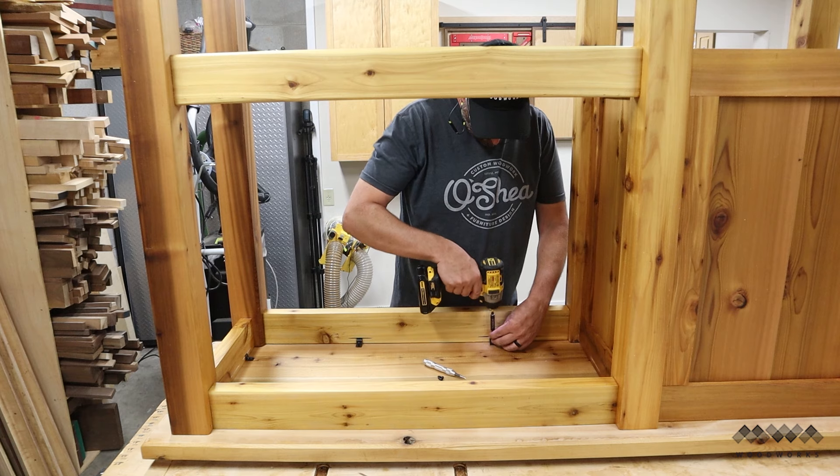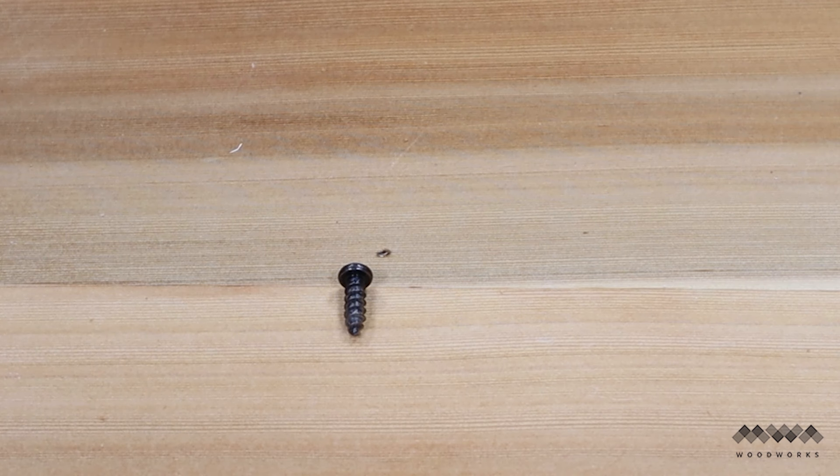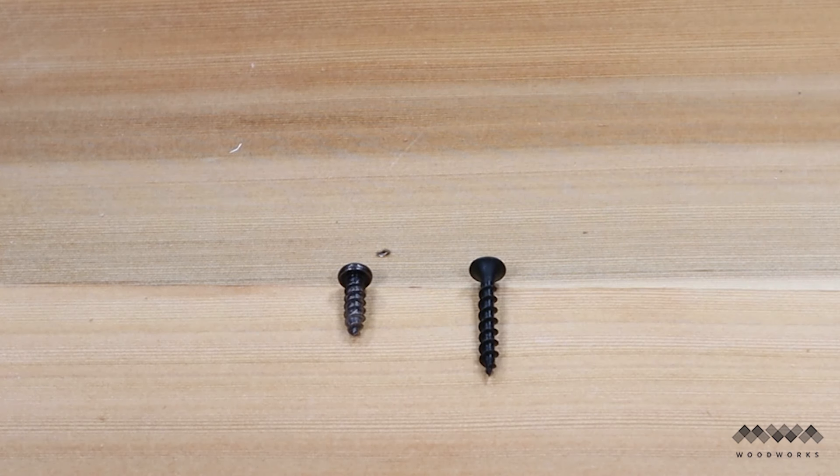I also added clips inside the storage cabinet, but it was a little too dark and cramped to show that on camera. One thing I noticed that I wanted to change was the screws that came with the z-clips — they weren't very big and a couple even stripped out as I tightened them down. So I switched to one and a quarter inch drywall screws, which have a lot more holding power, and my tabletop was thick enough at one and a half inches that I wouldn't go through the top.